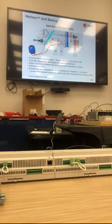When that is doing that, does that alarm that sensor that you can't get to? It's like down below that damper. There's a sensor in there. I called about that sensor on a unit at another site just like that. The actuator was loose on the damper, and we were leaking by, but it kept logging on that sensor. And I thought it was the sensor. I kept asking the guy in tech support on the phone, and he goes, you can't even get to that sensor.